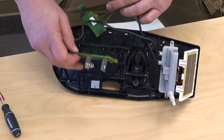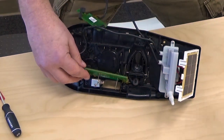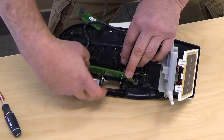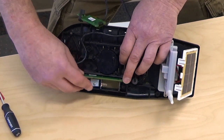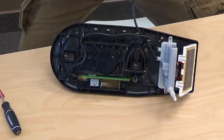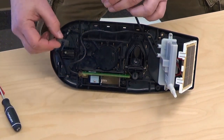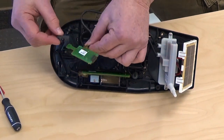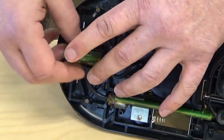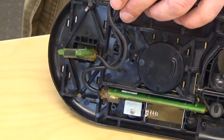The battery holder has two grooves it fits in. Note that the battery holder is to the left — the viewer's right — and these metal plates slide into these slots here. It should go down with just about no pressure. This is the gasket used for the temp humidity sensor. It fits over the stem and just gets pushed into the hole — it has no particular slots to hold it in place; the cover will take care of that.